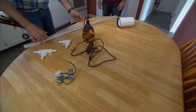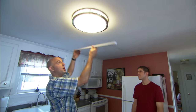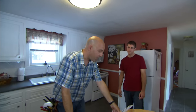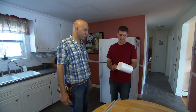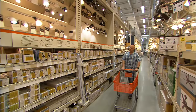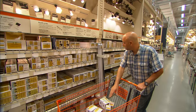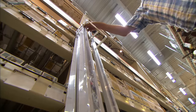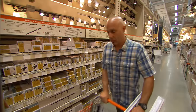Here's what I have for you: track lighting. We can put this track anywhere along the surface of the ceiling that you need to. Remove that fixture, feed it with power here — it can go over here, it can even go over your tabletop. Nowadays you can go to a store and find many different choices for track fixtures, like a low-profile LED fixture, pendants, or even a decorative globe. You can also buy all the track sections you need plus kits for adding power and making turns. It's really not much harder than changing a light fixture.